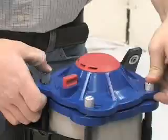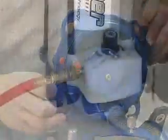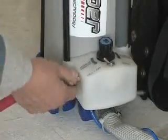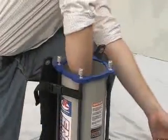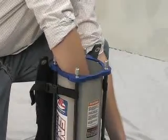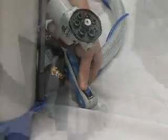If it does happen, the safety relief valve will make a distinctive buzzing noise. In this event, disconnect the inlet air pressure and contact customer service because the pneumatic assembly is not functioning properly and could cause component failure or user injury. Now that the lid has been removed, let's get the piston out. To do this, simply grab the blue handle on the piston, squeeze the trigger on the gun, and pull up.